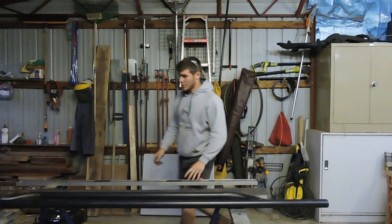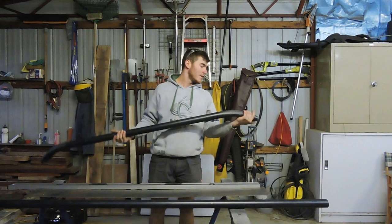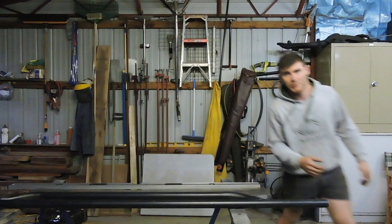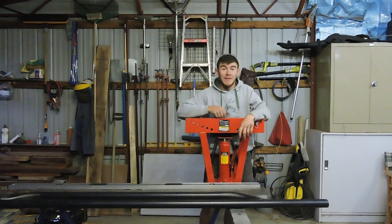What I have here is 40 NB pipe which I got from my local steel supplier, and I've just bent up one of the sliders. This isn't going to be a real how-to, just more of what I'm doing. I'm using a cheap hydraulic 12-ton bender I bought from Tool Shop. The bends are about 50 degrees - not perfectly accurate, but they're consistent.